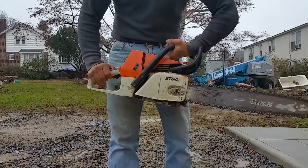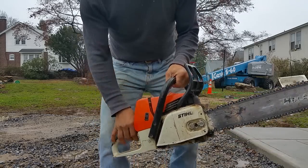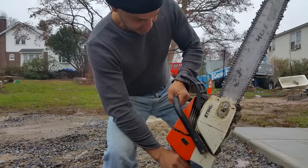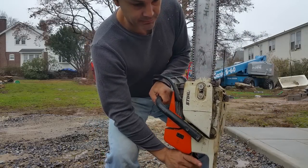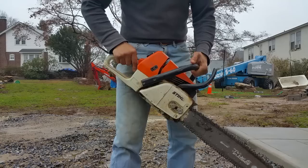When you finish your cut, immediately lock it. Your hand will never go into the chain if it's here — it can't be here and there at the same time. The brake locks. It works this way: it kicks back, it's coming back towards your face, and your hand will stay here. See how it hits? And now the saw stops — but it may still kick back, still may come and cut you, it'll lacerate you.